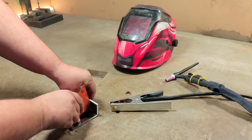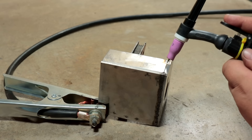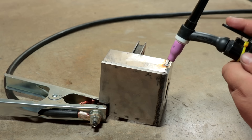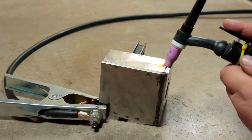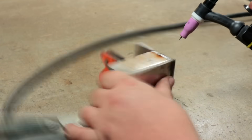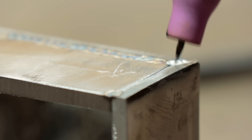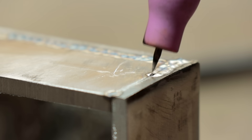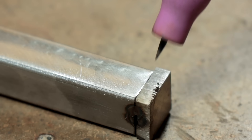Here I am again. As I said, the design is very simple. Two pieces of pipes — 15 and 20 millimeters. One pipe fits the other in size. I welded an elongated nut to the end of a small pipe — it is also an M10 coupling. A regular stud has the same length as the pipes. A rod moves along it, and a kind of frame for the engine I made of 5 millimeter steel. I love when everything is reliable — sometimes I even go too far.